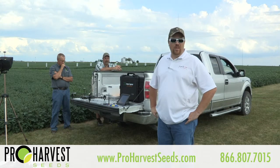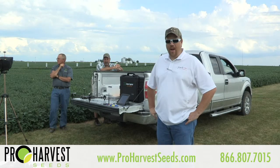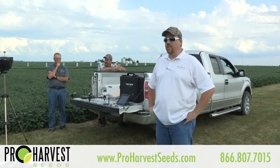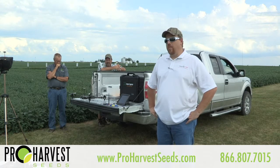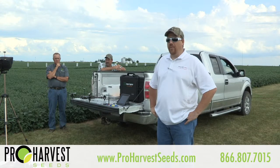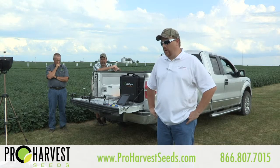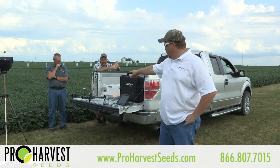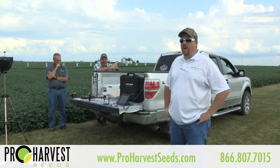Every single one we have has the capability of flying fully automated from an iPad or a laptop. You can fly it by hand and just skirt around and see what's going on. If you've got specific areas you want to do, you can set waypoints. I think you're allowed to set up to 50 waypoints. Again, depending on the platform and the battery, some may not have the ability to get out that far and back. They've got about a mile range in the base package. We do have packages that will get up to 10 miles, and the one we've got over there with the dual battery configuration is capable of 45 minute flight times.